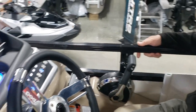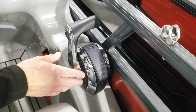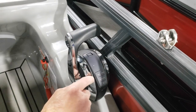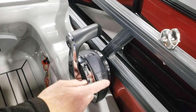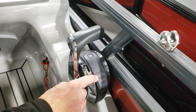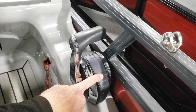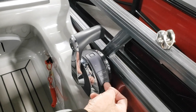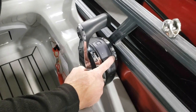When your boat is equipped with a 200 horsepower engine or larger, they will have the digital throttle — the DTS system — which has its own manual. Some things to point out: you still have trim up and down, but unique features include a throttle-only function. From neutral, push throttle only and advance the throttle to rev the engine without shifting. There's also a docking mode — nice for docking or putting it on a trailer — which reduces throttle response by about 50%. There's an illuminated light you can adjust intensity on, and a transfer button for dual-helm boats, which you would never use on a Regency boat.